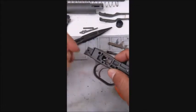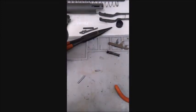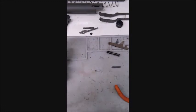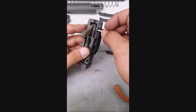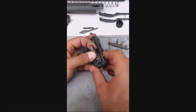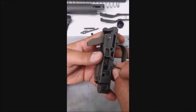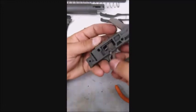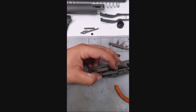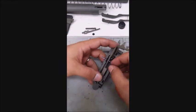And what I like to do is I just like to put a pin through the front of it, just on the spring, okay? Because what's about to happen next is about to get real damn difficult. Get the wrong pin in here. It happens. There we go. Now we got the right pin in the hammer. That's why it was giving me such trouble. Okay, so just squeeze that down, push it down with your thumb, slide that pin in till it's around it. Okay, and do not pin the trigger system yet, because we got a little something to do here. So we need to make sure our hammer is fully extended forward. Just like that. Okay, that's in place.